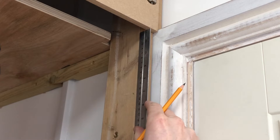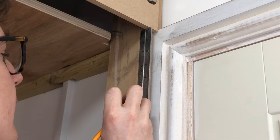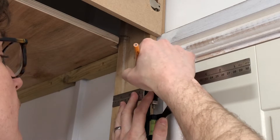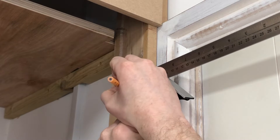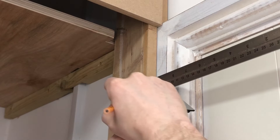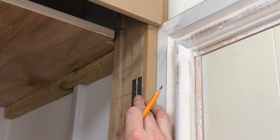So this is how I measure. I just get a straight ruler and try to line it up with any straight part. I need to measure down 120 millimeters plus 2 mil for the gap, and I make a mark there. Then I use my set square to draw a line across at that mark to ensure I've got it all the way down. To find where the screw holes go, as before, we measure 37 mil from the edge. Set your set square or a measure to 37 mil. It's also worth making a mark further up and further down because you won't be able to use a set square to get this straight. Your holes are 32 mil apart based on the middle line, so you find 16 mil - which is half of 32 - in the middle.